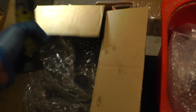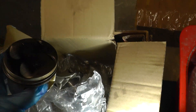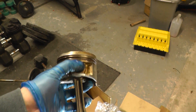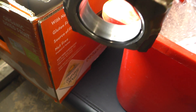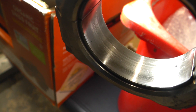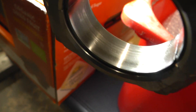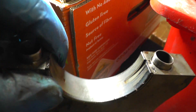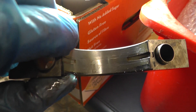If I go to the pistons themselves — the pistons are obviously not in that bad shape, although obviously used. So the bearings, you can see, are quite worn, and these will need replacing as well for the big ends. And if I just show you this — this is the bearing for the main crank bearing, and that's very worn too.